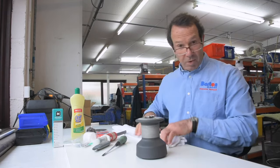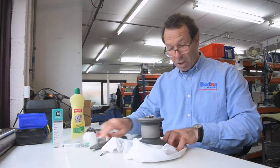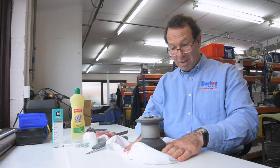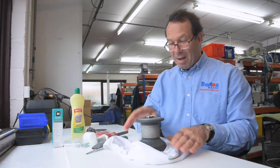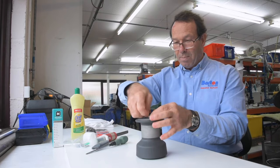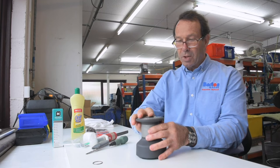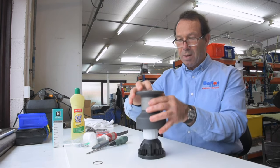First, if you're on the boat you might want to put a cloth around the base of your winch just in case you lose any pieces. First job: take off the circlip on the top — it's a spiral clip — and then you can just ease the drum off the base.